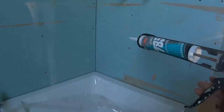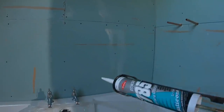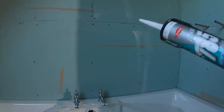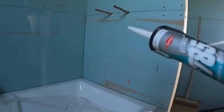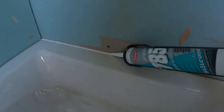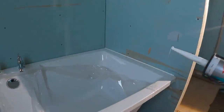I know people are going to say should aqua board it or cement board it or whatever, but as I've said all along with this build, it's owned by Scott who is a builder — this is how he wants it done. Moisture boards are going in. To be honest, I've never had a problem with moisture boards as long as the tiling is done right — there's not an issue. So we'll bang a bead of silicone along here, get it all in, then the same along the top as well — get it all in and it double seals it for when the tiles go on.